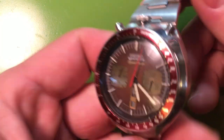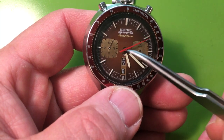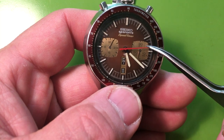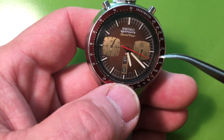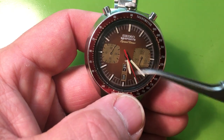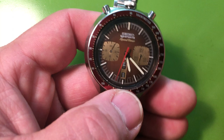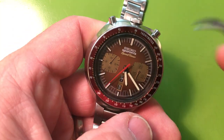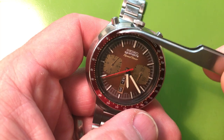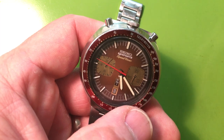Maybe they were just trying to do a quick clean. Everything about this watch says somebody was trying to make it saleable as quickly as possible. The case has been reworked, dial and hands are a little faded. It had some work previously — this is an original Seiko-made sweep, but it's not the correct one for this watch, it's the wrong color. That doesn't necessarily mean anything, since a watchsmith ordering a replacement sweep would get whatever substitute was available. Interestingly, the watch has new seals, but whoever did this later work didn't bother cleaning it properly.